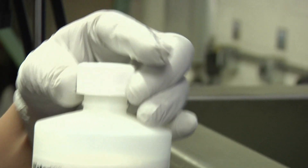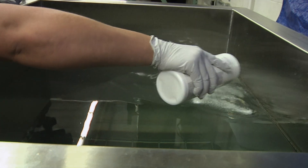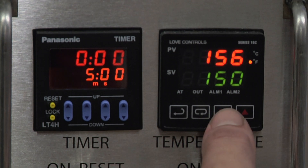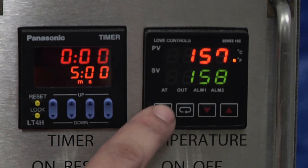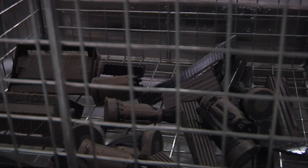To clean the support structure from an FDM part, use the following steps. Add the proper amount of Stratasys cleaning agent to the tank — one bottle is good for 11 gallons of water. Set the ultrasonic bath temperature to the appropriate setting as directed in the manufacturer's instructions, as different materials require various temperature settings.